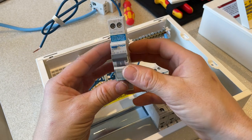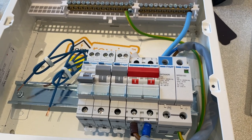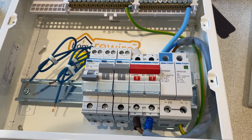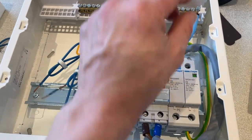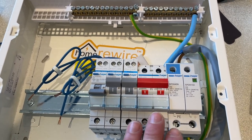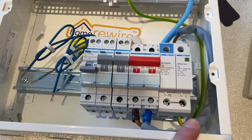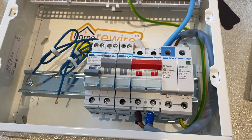These are a far superior option in our opinion but they do come with additional costs. Another popular option is what we call surge protection. This device is going to detect any surging power through the property, so in the event of a lightning strike any excess power coming through the house will cause it to trip out before it gets a chance to damage any circuits. There's some confusion in the trade as to when these are actually required — we don't install them as standard but it is a worthwhile upgrade if budget permits.